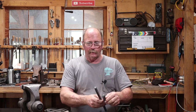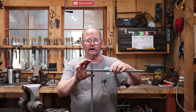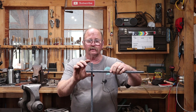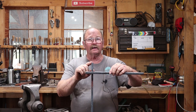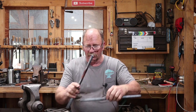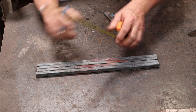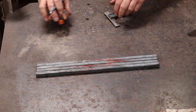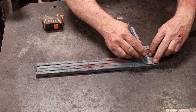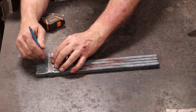Our bars have cooled, so now it's time to lay out where I want to put the joints. I'm going to cross these so there's going to be about an inch and a half above and to the side of each one of these. Ultimately I will upset the ends just to give that a little bit more character. So I'm going to come in an inch and a half — about 38 millimeters — from each end of the bar. Again, there's nothing special about these measurements; this is just kind of a practice piece with arbitrary measurements.